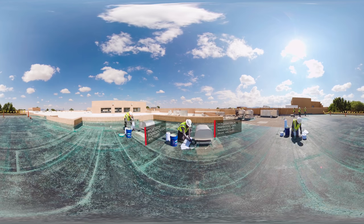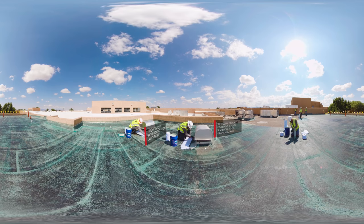The next stage is to seal the roof using Hydro Stop Foundation Coat and Fabric. It is important to thoroughly seal all penetrations, joints, transitions, curbs, drains and walls, since most roof leaks occur at these locations. Like you can see here, these pipe boots were properly flashed and sealed.